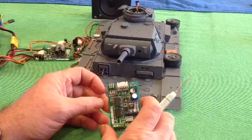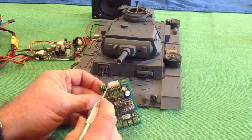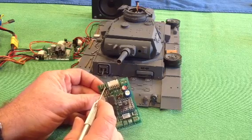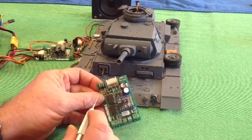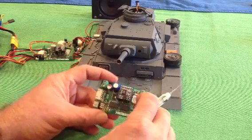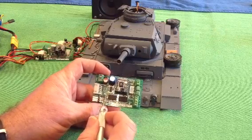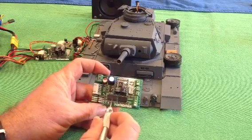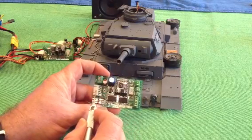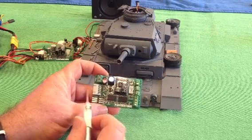Panther Term — 3-channel operation board, 2.4 GHz. We have 3-channel input here. That channel is our switch channel. Once the Panther Term receives 100% or full throttle on that channel, it turns on. We have our gun control channel and our turret control channel. Immediately above our channel input, we have our programming port. We use that to update the firmware running on the micro on Panther Term.